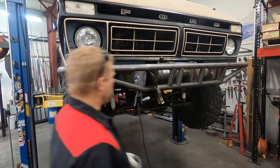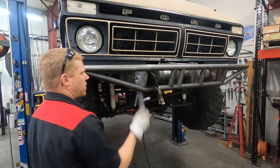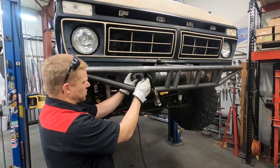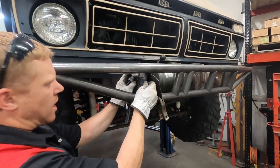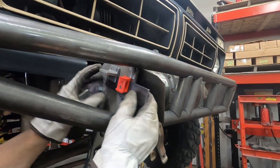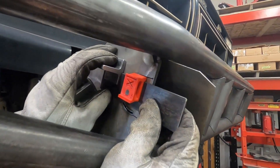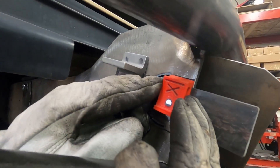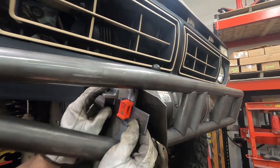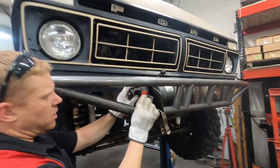Now we need to do a couple of straight cuts. Let's knock off any of that slag. This is where we go back to using these little mag holders and also where I like our offset blocks — to make sure we're going to be in line with things. That's going to help to put the waste on that side of the line and should line our two cuts up pretty good.